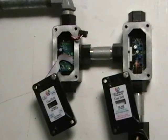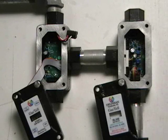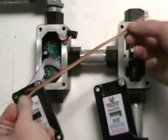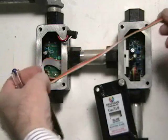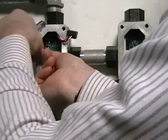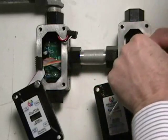Once the components are mounted, wiring them up can be accomplished by pulling a 5-conductor cable between the individual modules and a 2 or 3-conductor cable to the power supply and signal output, then terminated using the supplied 5-pin terminal block. For this video demo, we have used short lengths of conduit and therefore short wire runs, but you will need to pull the cables through the conduit using your typical pulling techniques.